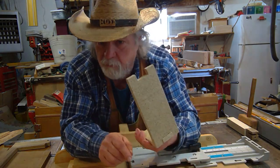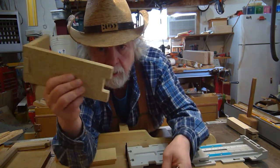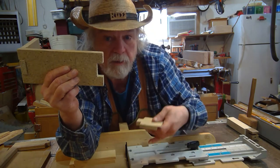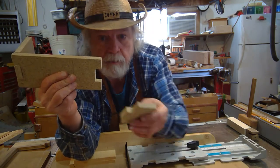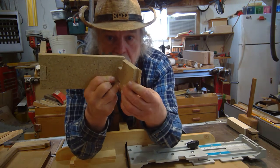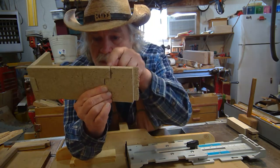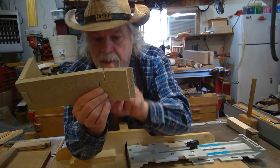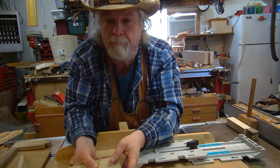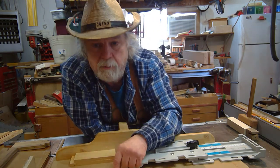It has another fringe benefit: when you make the joint, if you take a little extra off of the inside of these two fingers — which you can do on the incra — you get it this way, and now all of a sudden you have the makings of a hinge. You just drill through this way and this way, put your pin in — two pins, one from each side — and you have the makings of a nice little shop-made hinge. I make hinges like that all the time; it's really pretty easy to do. So the three-finger joint is the key.